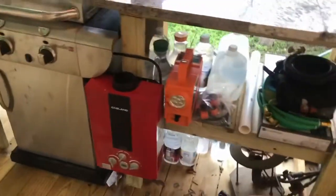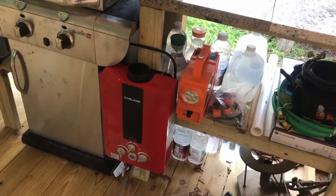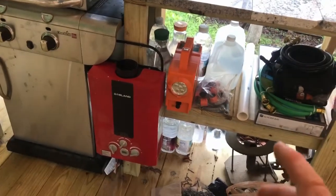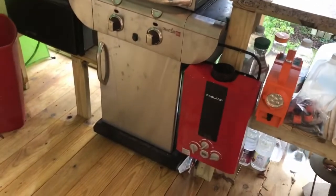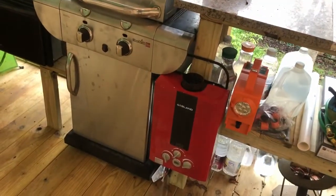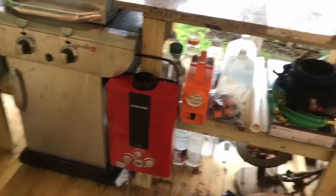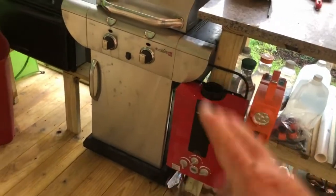And then I've got a high pressure battery powered water pump right here that I'm going to rig up, using splitters and a bunch of garden hose, got some short pieces of garden hose there. I'm going to run and hopefully be able to feed water from a large tank and run that through the pump, and cold water will split off and go over to the sink, and then the other side of the split for the cold water will go into the heater, and we'll be able to pull hot water from that and send that to the sink. Running hot water coming off the hot water heater over to the sink, as well as hot water going into the shower.